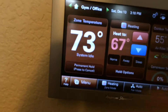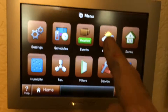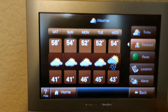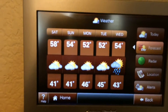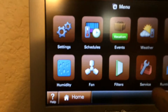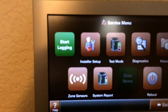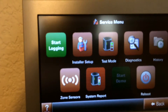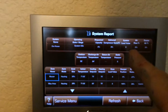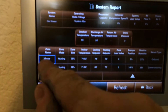We got the gym office area there too. I can go to the menu and do a lot of cool stuff. We got the weather, the five-day forecast, and we can get the radar. So amazing stat. I like this option here — we can go to service, technician access, proceed, system report. So requested capacity, delivered compressor speed, airflow, excess air, return air temperature, discharge air temperature. It's got everything about that zone.